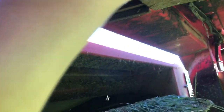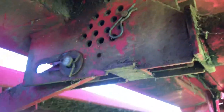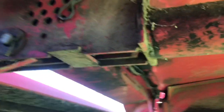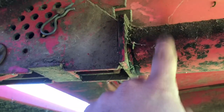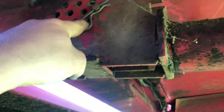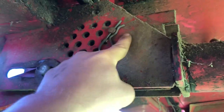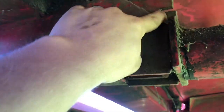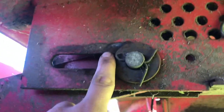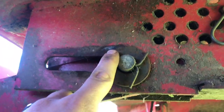I want to tilt the header up as much as I can. This is in the circuit with the up-down cylinders, so when you put pressure on it to lift it up, it puts pressure to this cylinder which picks the header up. Whenever you let it down, it lets it down. Well, this here is a stop — the further back it is, the less this can travel. You can see right here is how far down it was going. Now it might move a little bit for it to seat on this pin, but other than that it won't move.